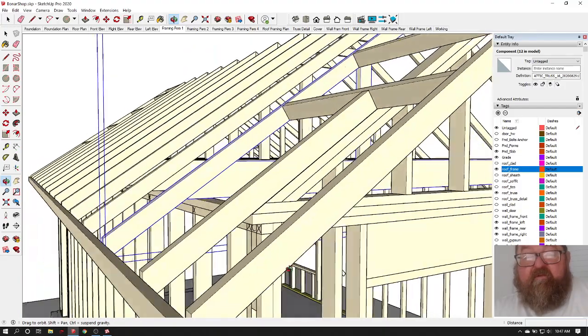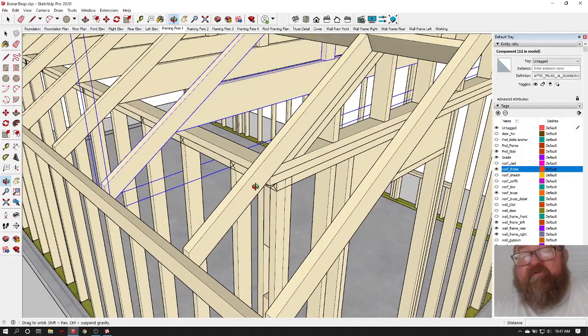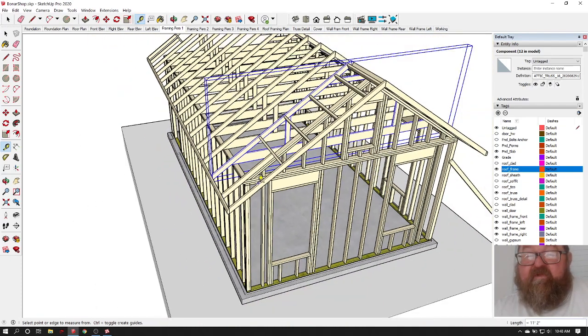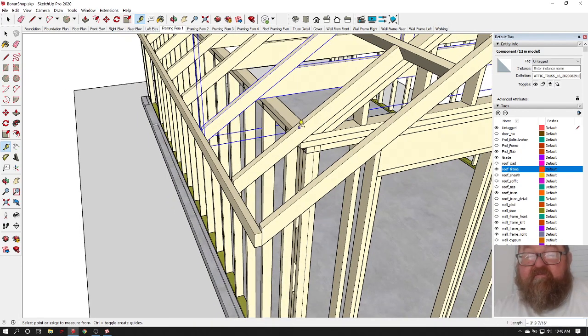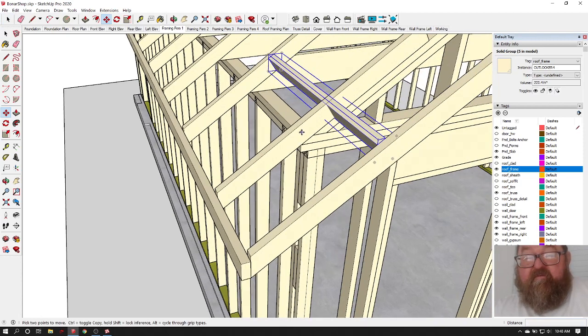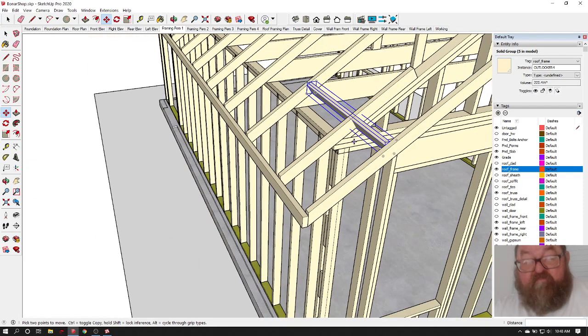Okay, now down here it gets a little funky because you need your rafter tail to keep going. You need your rafter tails here. So what you'll do is you'll come back up here, what is this, 4 feet? You'll have your rafter tail be about, yeah, this is about 3'9". I think what happens is these are spaced from the top down or whatever. You just need a decent amount here on top of this wall, so this part of the tail will cantilever fine. You wouldn't want this block, this outlook to be down here, because you wouldn't have much support. This part here would just be sitting on that short part there. So this gives this a long place to sit.